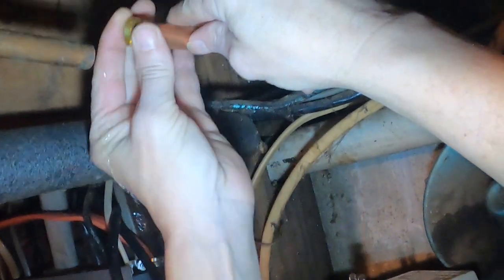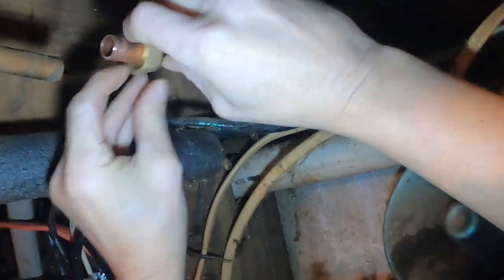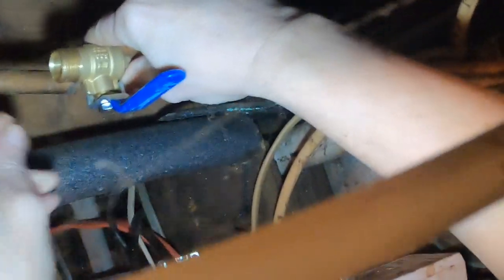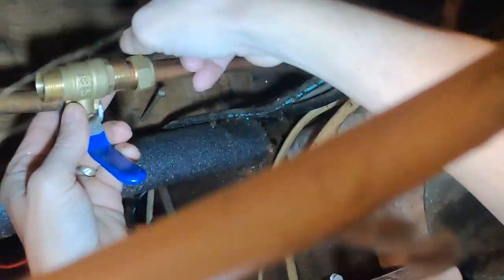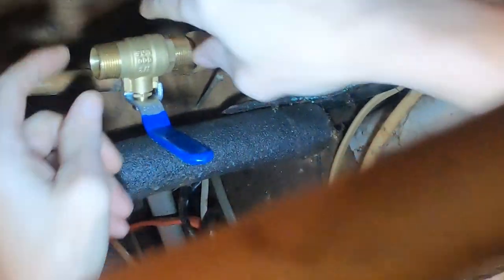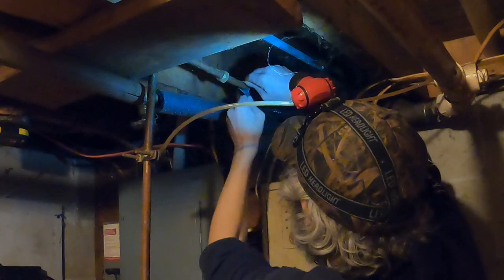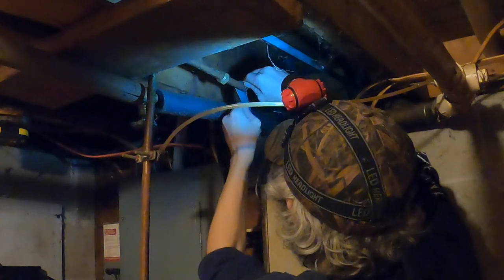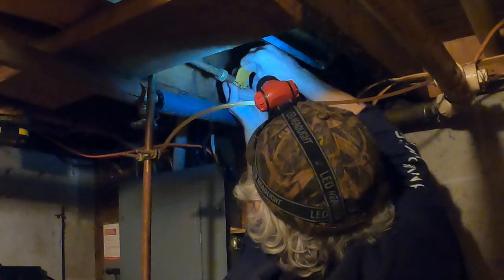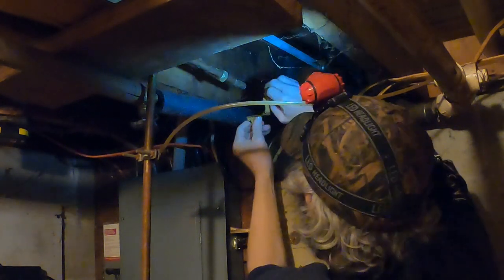I cut the pipe too short, had to go up to the hardware store and buy some more pipe. Now this is just going to fit in something like that. I don't have enough room right now - I'm going to have to loosen up the outside so I can fit that back in. Basically you should leave enough space to fit between here and here, so that the compression fitting will actually compress. Seat it down a little bit. You don't want it to leak.